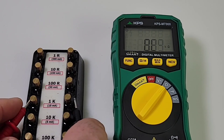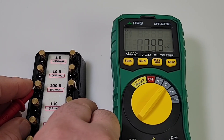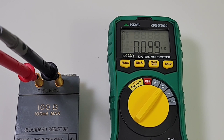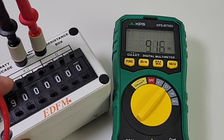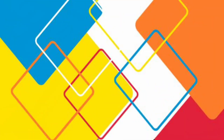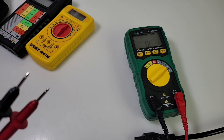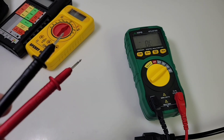Staying in resistance: 9.99 — no worries, 1K. Very smooth, 0.998 — very close. Let's try the 100 ohm. Coming up as 0.99 — just shy, very good. Let's see how quick it is ranging: sitting at 9 megaohm, 8 megaohm, 7, 5 megaohm — a little slow — 3 megaohm and 1 megaohm — not so bad. Now for continuity. I love it — stock default probes. Remember last time how good it was on that cheap Neotech — probably the best continuity I'd heard in any multimeter. Here we go.